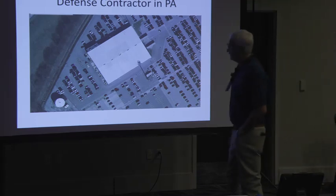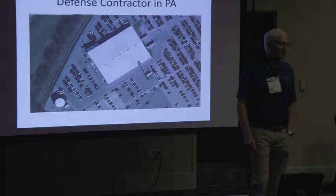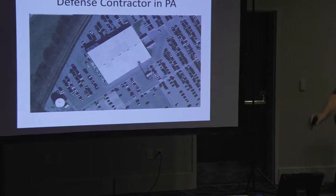And then they had an engineer come in and look at their building, and they said, you can't add any weight to this building. In fact, if you do anything, you're going to have to take the roof off, and you're going to have to add a purlin in between every purlin on this entire building. So now we're talking about a 30-foot wide hole in the roof, 90 feet long, just to add the purlins. You can imagine the disruption, the cost.